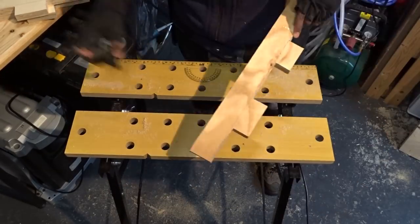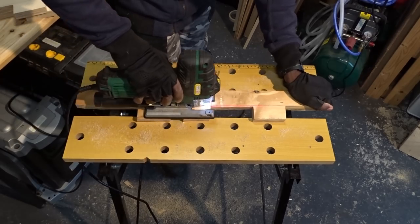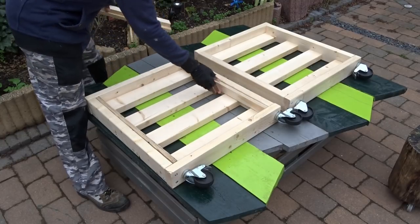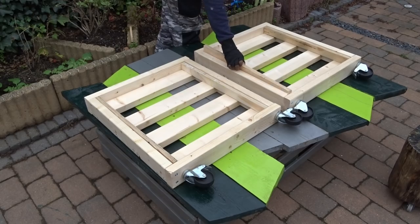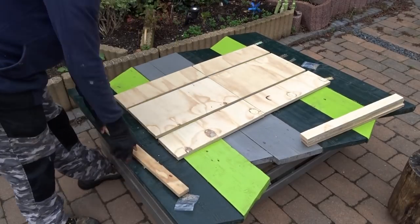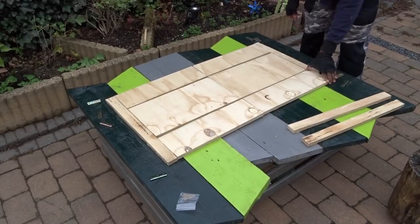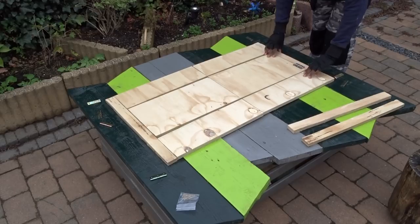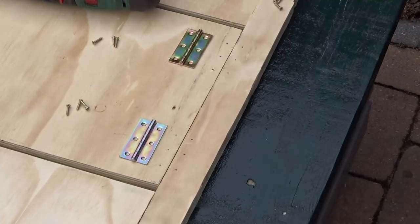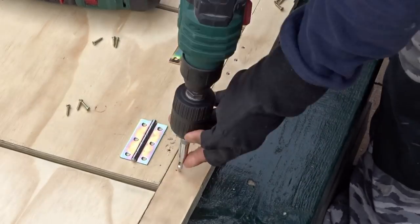Now I am trying the slats on each side of each frame to see if they fit well. When this is done, it is time to attach them on each arm. Please note that before screwing, you will need to make sure that each hinge is facing down. Before attaching them, I have decided to pre-drill some holes as I am very close to each side — this will avoid breaking the wood.